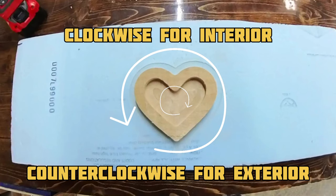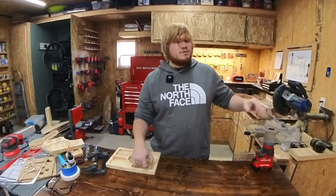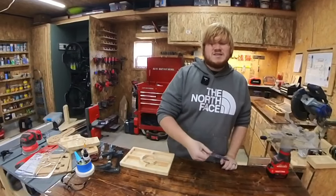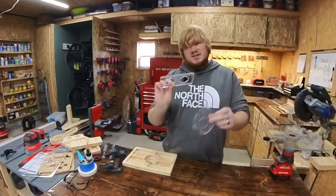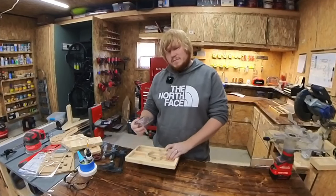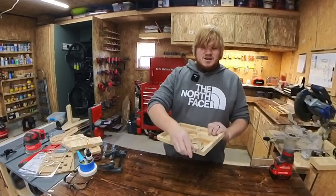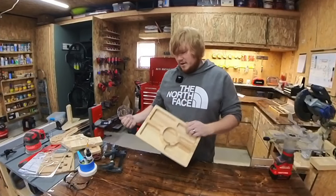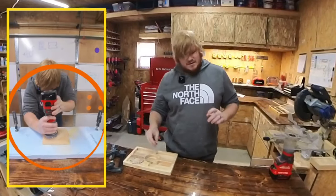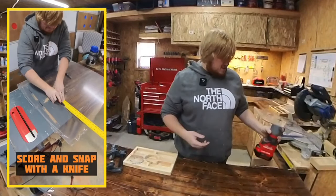This is called a push cut and gives you better control. It also prevents the router from jumping ahead. You can also use these in a tabletop setting, but then your template is upside down and less safe because you can't actually see your template. If you use your palm router way too much, you'll know that it comes with a small base standard in the box, which for most small projects isn't a problem. But for some projects it can become unstable because it can't span the entire cutting area. I did film a short DIY on how to make a larger router base out of a piece of plexiglass.